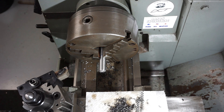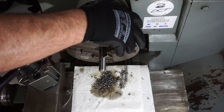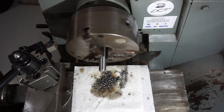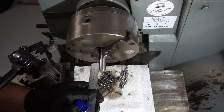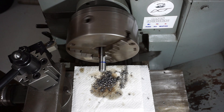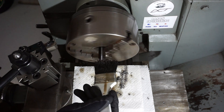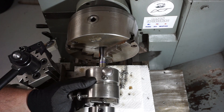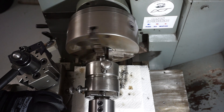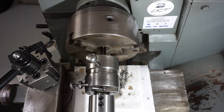To use the Coventry die head I've got to move the saddle lock of my lathe all the way up to the chuck, and that gives me access to it. With the tail stock, I'm dropping the RPM right down here, roughly about 75 revs per minute. That gives me enough time just to catch that Coventry die chaser. You can see I'll be threading very closely to the chuck, so I've got to watch that I lock the tail stock in time for that Coventry die to disengage. Last week I was locking the tail stock and feeding in with the handwheel on the tail stock. Here I left the tail stock floating and just pushed a little bit of weight on it to get it to start — it pulled itself up, and when I got to depth I locked the tail stock. You'll see how I lock it and bang — it pulled straight out without a problem, and I was getting some really nice threads.